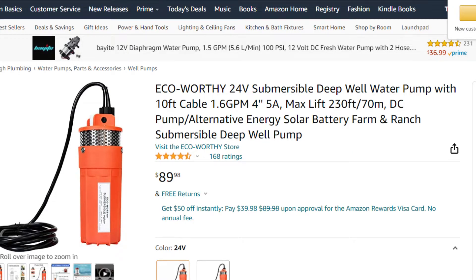In my California off-grid home, I wired all my lights for 12 volts. You can wire a house with 24 volts nowadays — they make a lot of 24 volt accessories, lighting, and everything else. There are quite a few things you can run directly on DC, which is a real benefit. If your inverter ever goes out, you can run priority loads on just DC current. My well pump runs on 24 volts, so if my inverter goes out, I still have water.